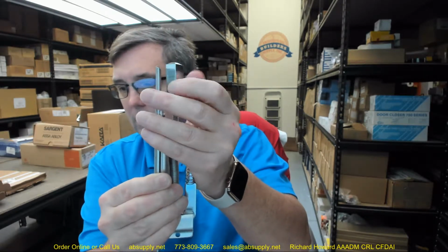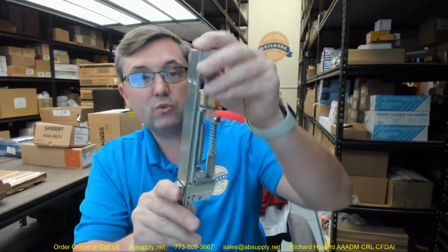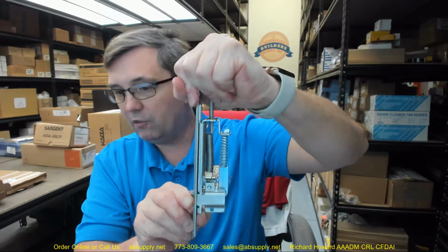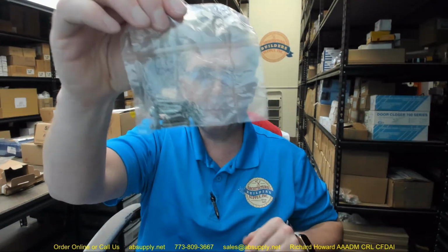Low closing force, that means your door closer, even a handicap compliant closer, will still activate this. Override feature, we have demonstrated that. It will override. Satin stainless steel. What they do with the finishes on this hardware is the faceplates. You're swapping out faceplates. You are swapping out the strike, and then the scar plate. I think they're both really called strikes. And then your screw package. That's all you're swapping out. Everything else is the same components.